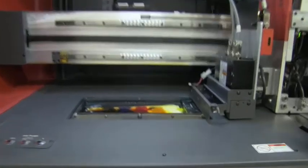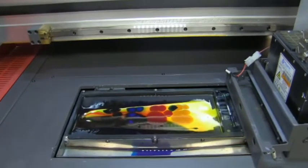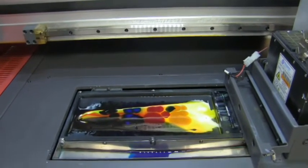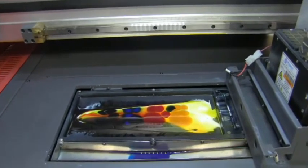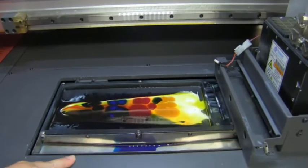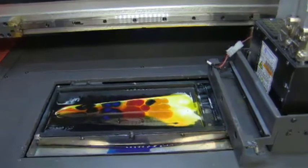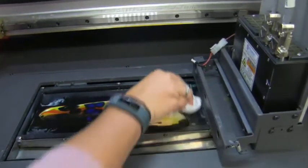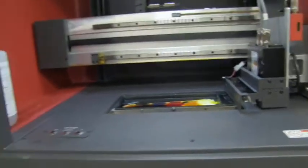What you're looking at here is the main catch basin for any purging. There's a small hole in the back left corner where all your main ink is going to drain. If you do any bleeding of your lines, it's going to purge here. This is the air knife that rose to the surface and suctioned off your excess ink. You'll want to keep that clean as part of your daily maintenance — just wipe it down as needed because it does come in close contact with your jets.